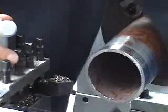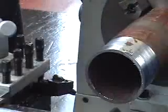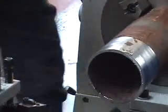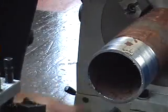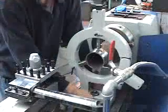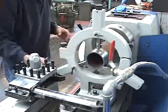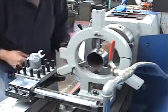Keaton's going to bring the steady rest over, but before that I want to clean the area. This is our newest machine and I want to make sure there are no metal fragments on the bed when I put the steady rest on. I'm just going to tighten down the steady rest — I've got it back a couple of inches and that's secure.